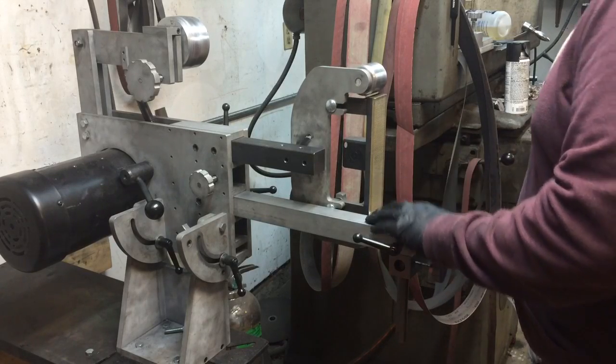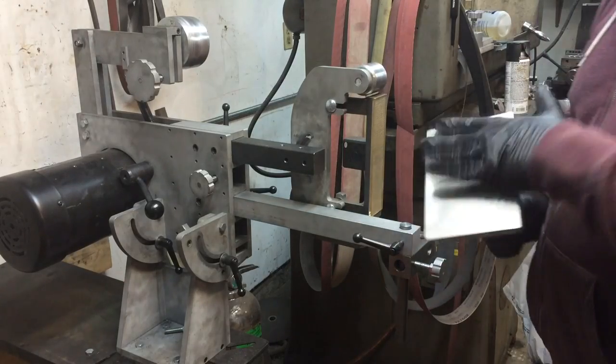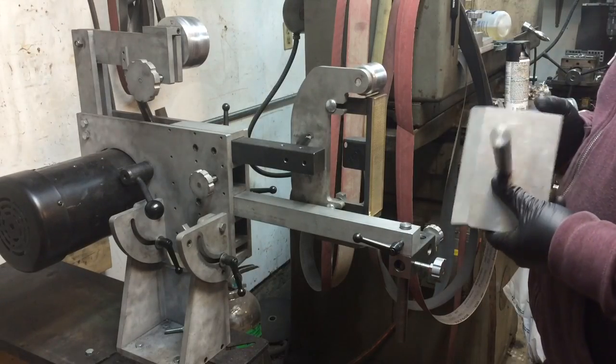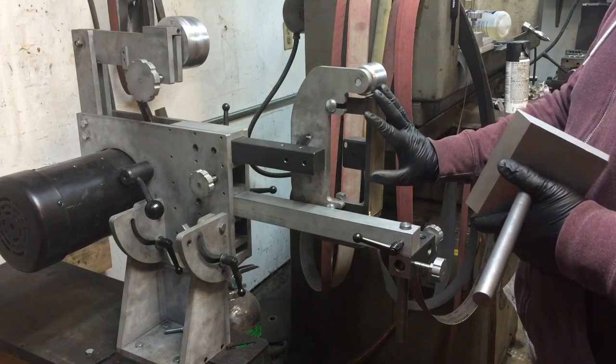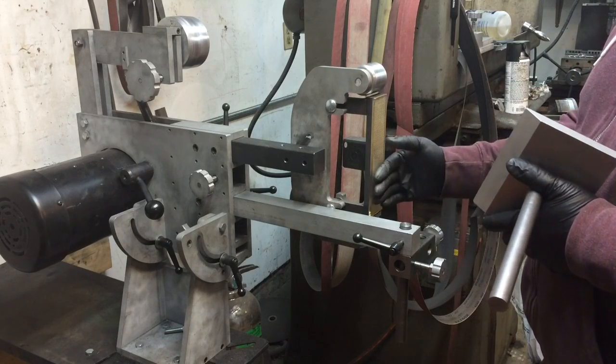Finally, you'll have some kind of a work table. This is a general-use flat table — it's chamfered 60 degrees on one edge, which will come into play a little bit later. In horizontal mode it's also helpful when pivoting your platen back up to 60 degrees, so you can get in much tighter to your belt and your platen.